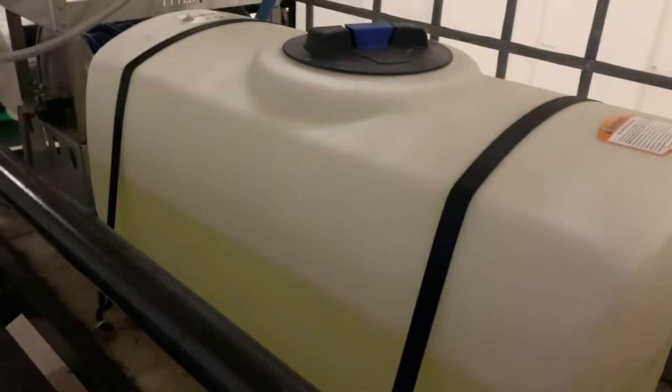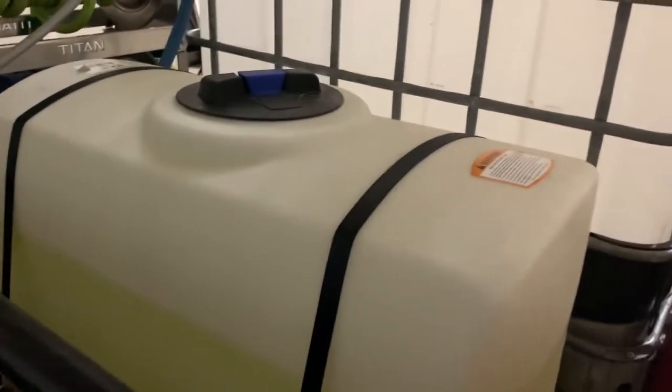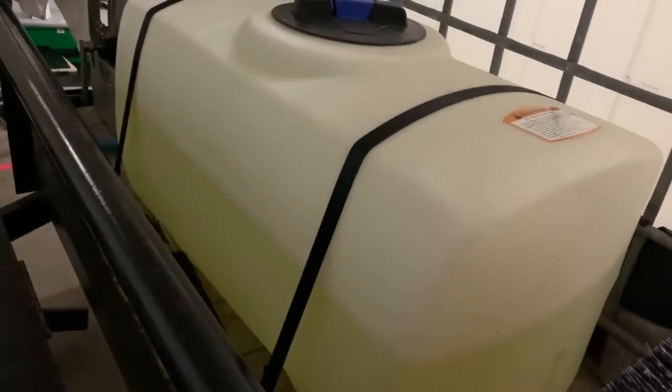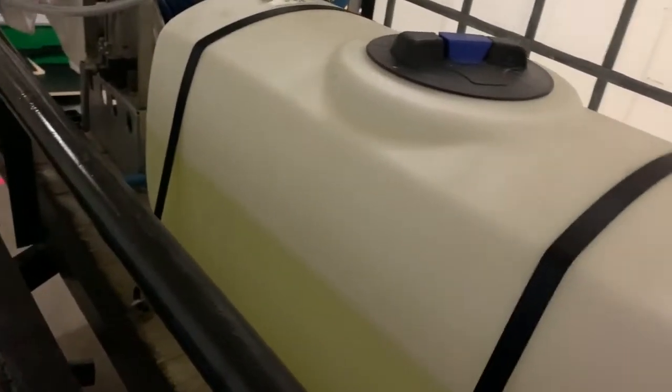The problem with that, and I know this is a debatable issue, but it had a bulkhead fitting down at the bottom, in an area down there, to where you could drain it or whatnot. What happens when you store straight SH bleach in those tanks is it tends to degrade the seal, and pretty soon it's going to be leaking all over the trailer. Let me show you.